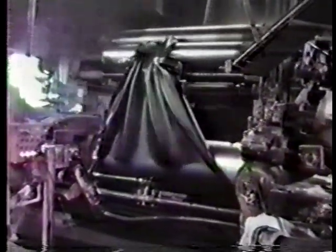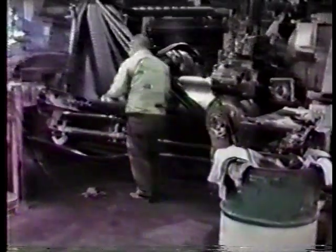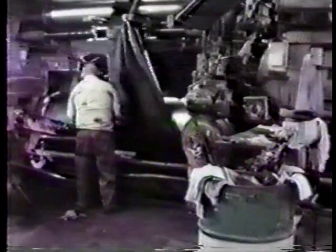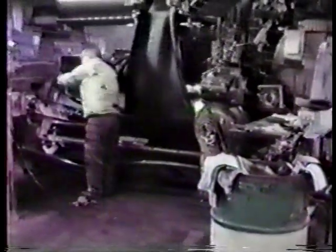Ready to remove the batch, he raises the slab off conveyor and cuts the material down from the blender. Start his knife, start his slab, and it moves up through the stitching rolls and through the dip solution, and then up this sharp incline conveyor where it is festooned on the Akron standard type slab cooler.